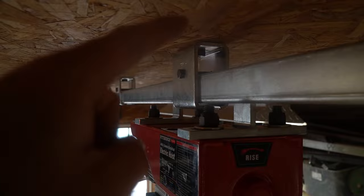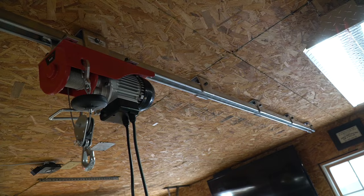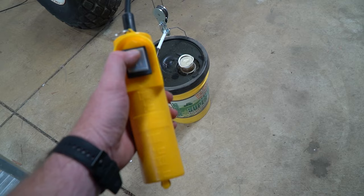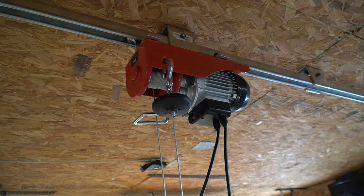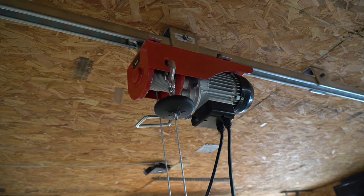It also gives it clearance for the wheels inside. Above the bottom of the track that the hoist hangs on is another piece of Unistrut on the rafters. It lays upside down and you can see a half-inch bolt that corresponds to the bracket. I can hang from this rail and I don't see much flex in the ceiling, if any at all. The hoist works from a very simple wired hand control — just press up or down. It's quite slow when you double it back, which can be very handy because sometimes you don't want to make knee-jerk reactions or pick things up too quickly. It does make some noise, but it is not incredibly loud.